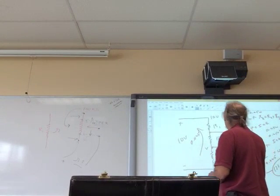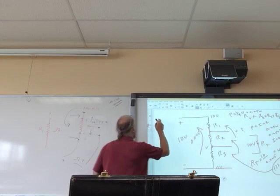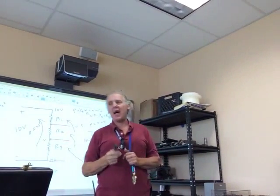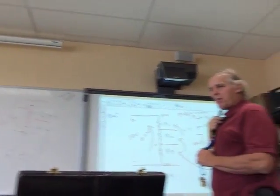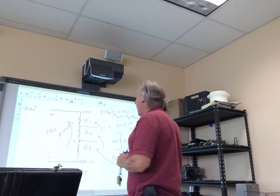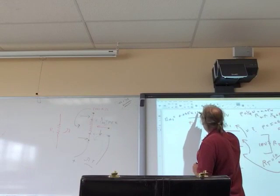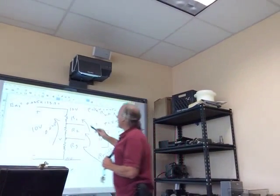So let's see, for R3, let's do it right over here. E across R3 equals what? We've got the current and the resistance. It equals I times R, right? I times R, 0.025 times 133.3. What's come out? 3.3 volts.